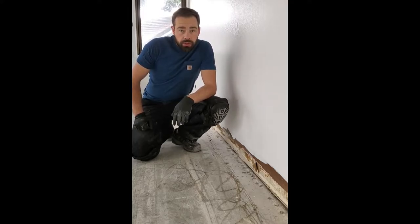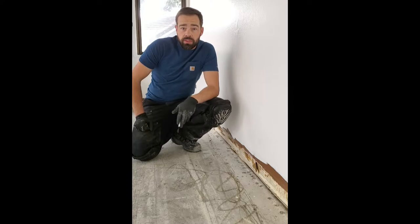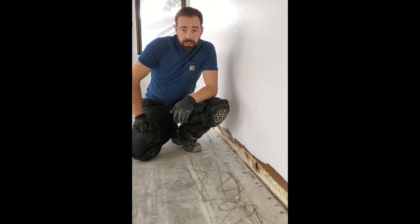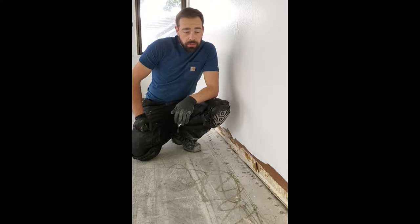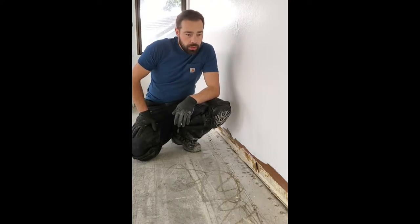So to repair it, we're going to use the Duraamen product called Param FP. It is designed just for this task, repairing little damage areas like this. It is cement-based, but highly engineered for performance. Very high compressive strength. It sets very fast, so I'll be working with very small batches. I actually mix it up in a solo cup. You'll see that I use solo cups for about everything under the sun. So about that kind of volume is what I can work with in this format, working with these small repairs. I'll get it in place, I'll tool it flat, and it'll be ready to be ground with the rest of the floor tomorrow.